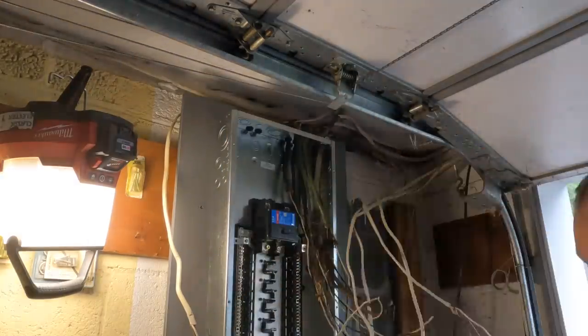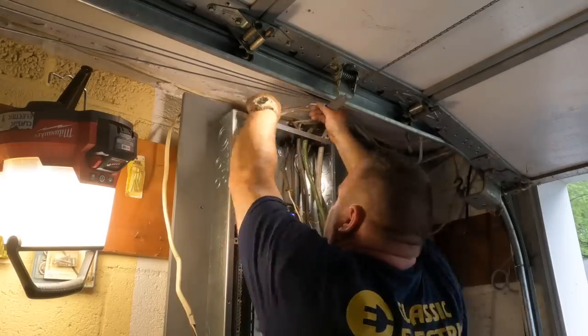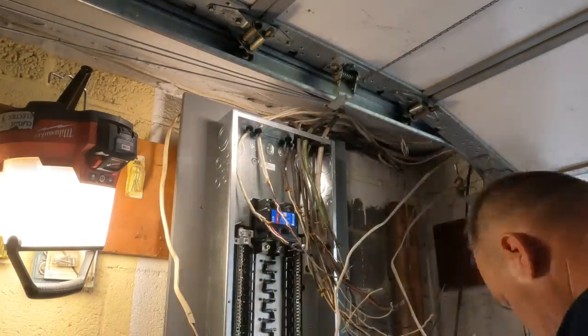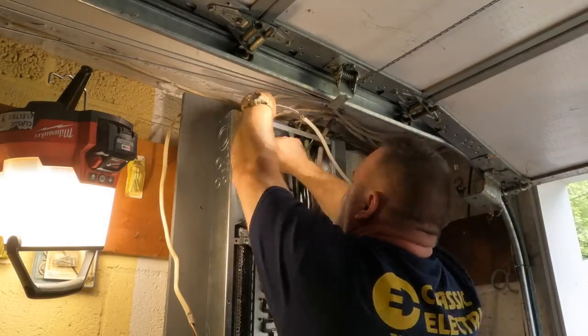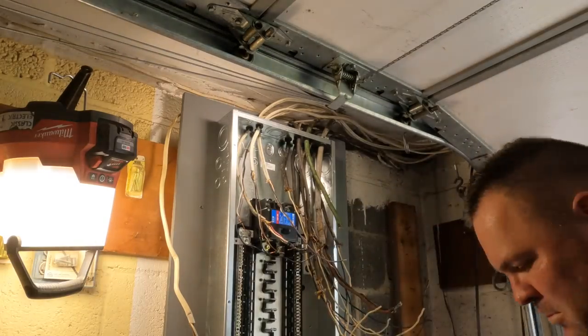Getting back to this house — no central air conditioning, so maybe 14 circuits, and there was a multi-wire branch circuit, so at that point I have to do a double-pole circuit breaker because it has the common neutral. The code says it needs a common trip for both of those circuits that the neutral is providing neutral current for. Hey, if you like this video, do me a favor — hit that like button, hit subscribe, hit the notification bell. Thanks for watching, we'll see you on the next one.